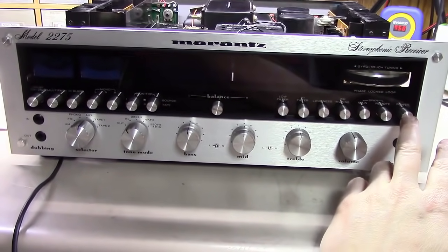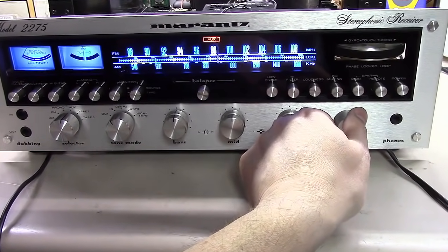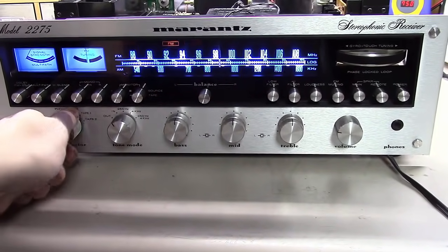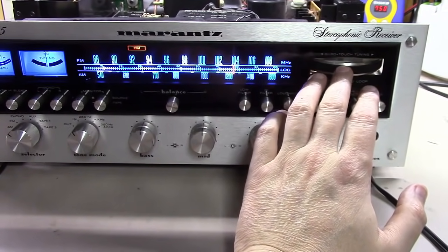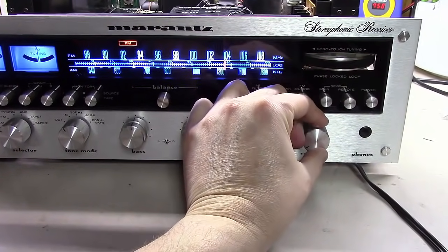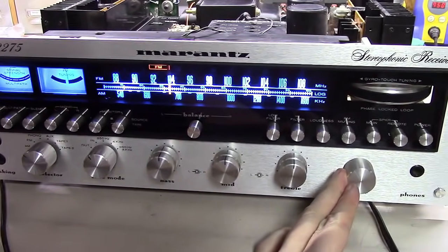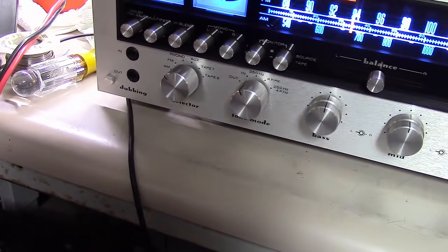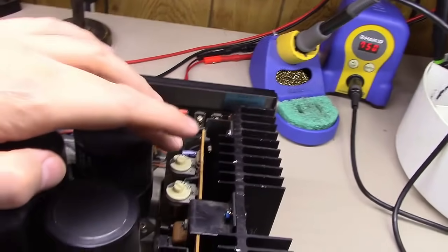There she is back together — sounding great. FM is a little tough down here in my basement but every once in a while I get a signal. I'm going to hook it up to an FM antenna and check out the FM section real quick. The FM section turned out quite well — I used a little Terk indoor antenna and moved it around as needed to get a signal down here in the basement. What's really left at this point is biasing the two outputs — one trimmer is idle current, the other is DC offset.